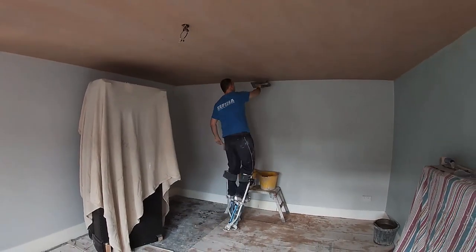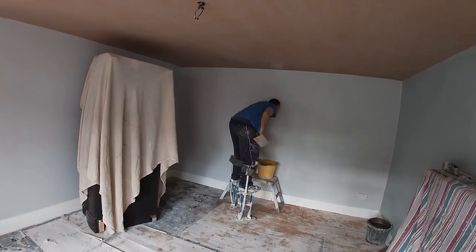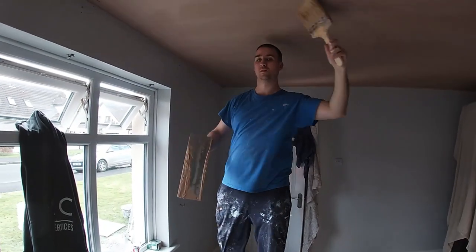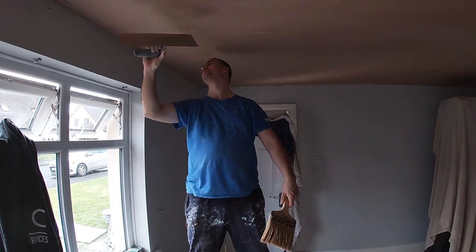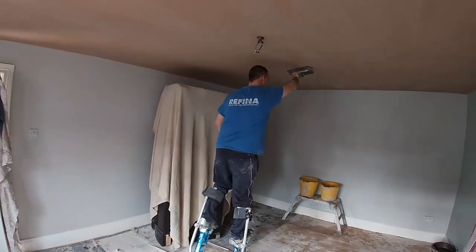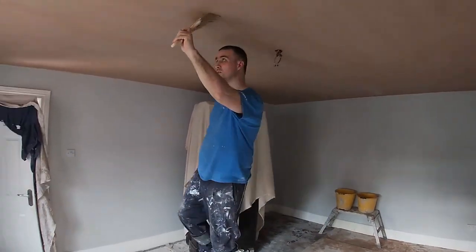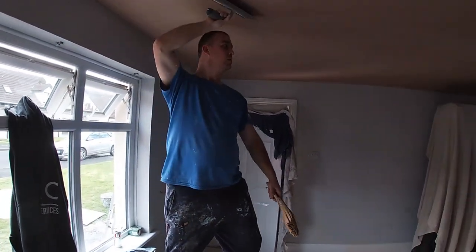It's quite a length of ceiling so a good test for these trowels. The new stainless steel trowel I had for coating — it's not properly broken in for a full trowel, a bit of a look, not really taking much fat off. The trowel is still sharp enough and strong enough to cut back any bumps on the ceiling at this stage, and again obviously fill in your holes as you go. Definitely find these flexi trowels take a good bit of strain off the arms.